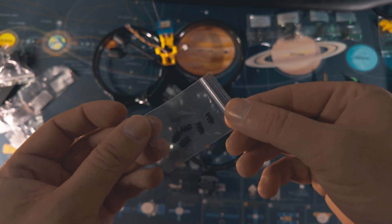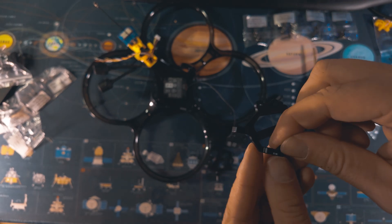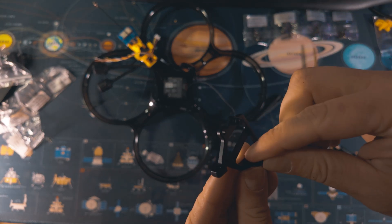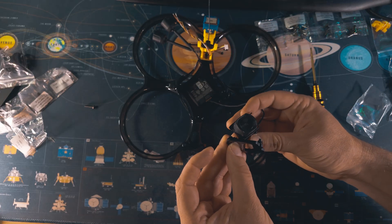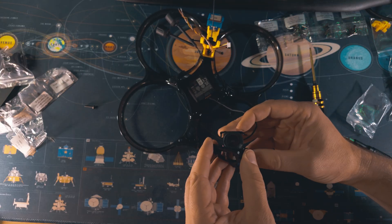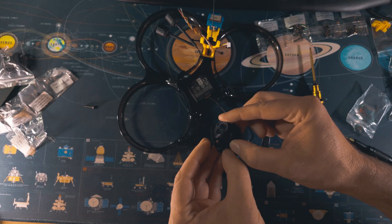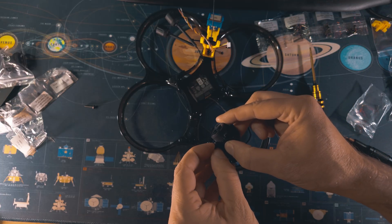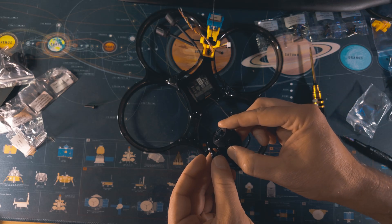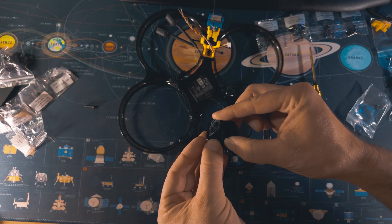There are silicone bumpers included to mount the camera shell to the aluminum chassis. You have to fiddle them through the aluminum cage, which is one of the parts that doesn't make a lot of fun. But once that's done you just need to fiddle them through the hooks from the plastic casing as well. Once done, you have pretty good dampening for the camera itself so you will not suffer from jello.